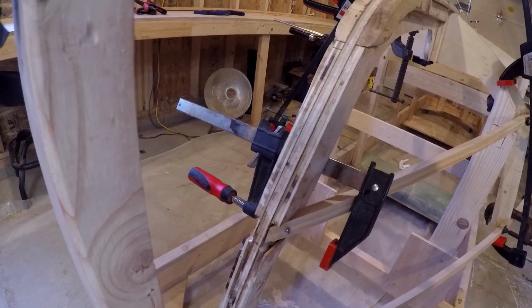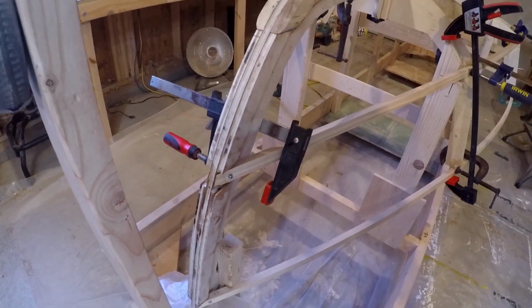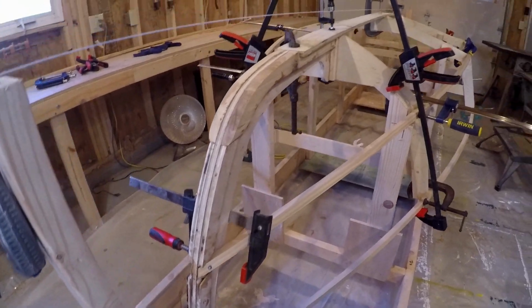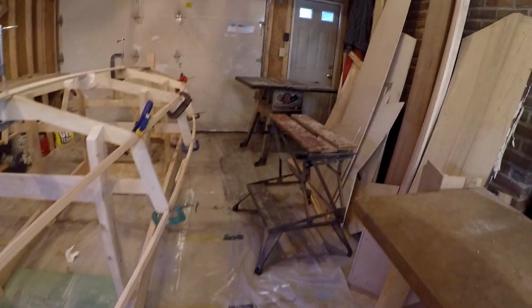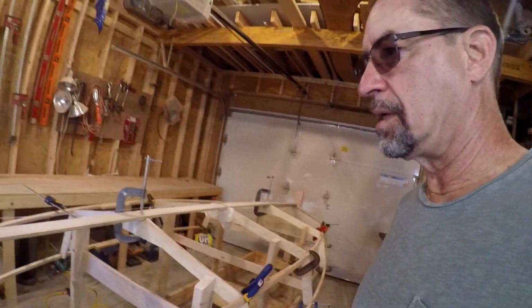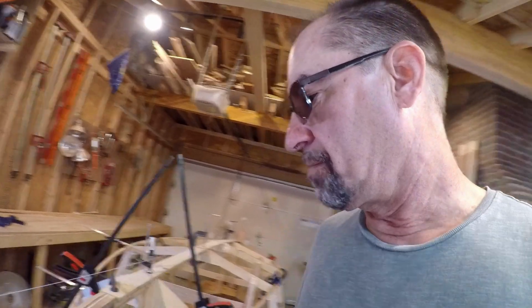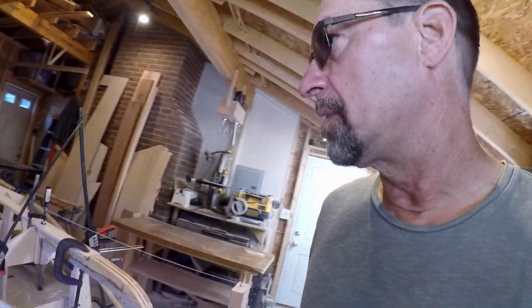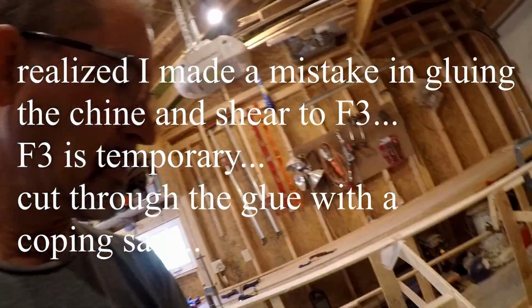I'm just going to mix up some putty epoxy with a little bit of filler and close those gaps and give it a little bit more time to cure. It's actually, weather's starting to get nice and fallish and cold, so since epoxy cures by heat, we're going to be battling that as this project goes forward.